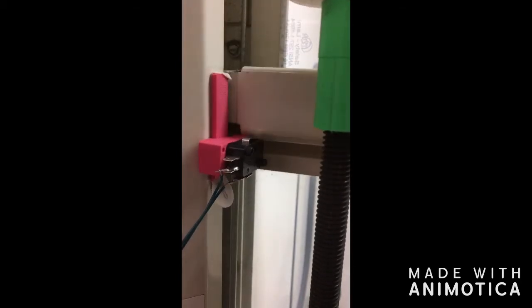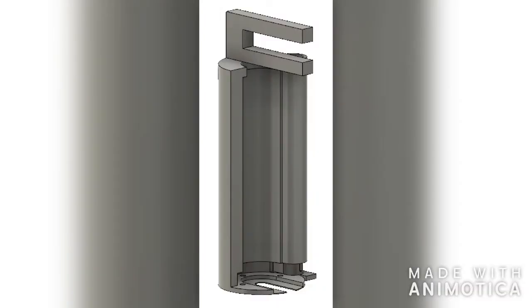The pusher also has a 2-inch square rod that extends from the left edge of the pusher towards the fume hood's wall. This rod presses a limit switch once it has been raised to the open sash position. Once the pusher has pushed the sash to being completely closed, the top of the sash presses a separate limit switch. The motor's 3D printed casing has two pins that fit into two holes on the main attachment piece.